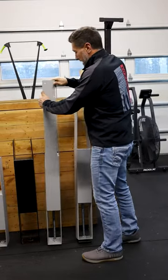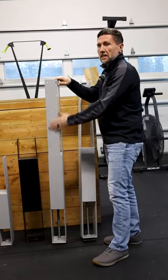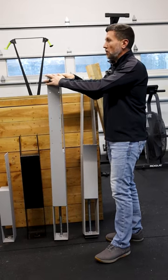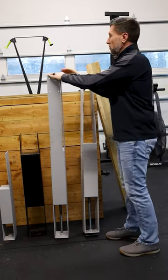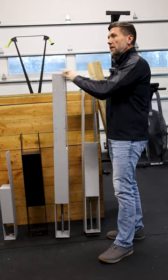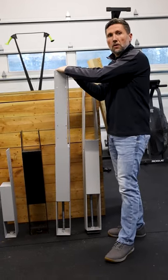If you look at this bracket with the metal facing you, this is going to be the inside of the building. The strap is on the right hand side. So in an overhead door situation, this would go on the right hand side of an overhead door, and it would go on the left side of an outside corner post.